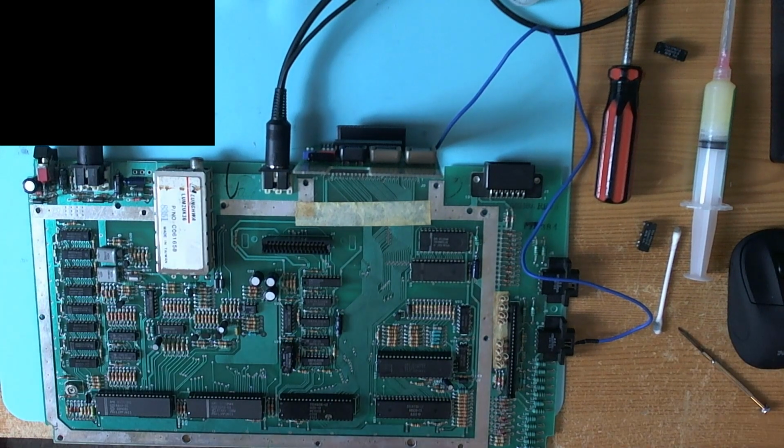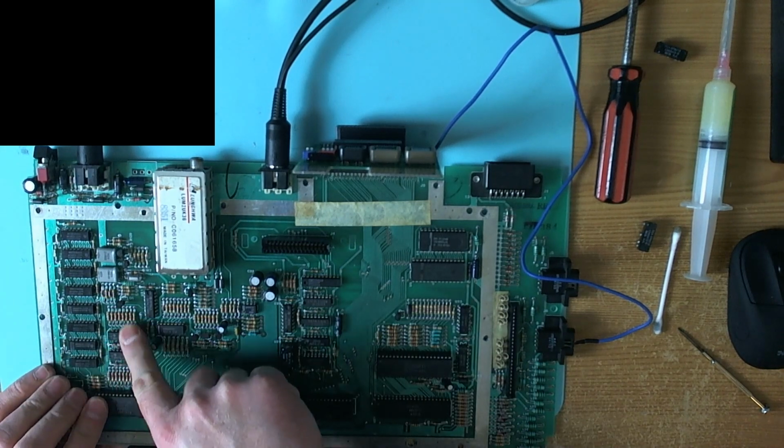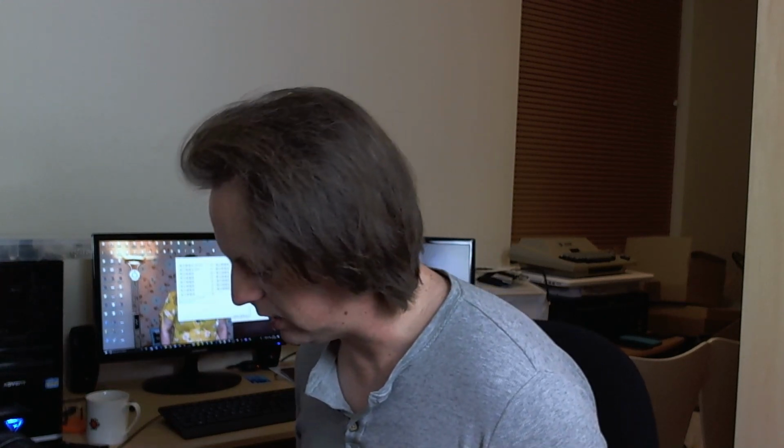Okay, so I'm pretty much at the point where we're going to start replacing this stuff now. So with this machine so far we have looked at the delay line. Fancied that it would be nice if I had the same problem on two machines in a row. That's proved not to be the problem. We've checked the relevant chips that are already in sockets. So the next thing I'll probably try is the 74LS158s. I will socket those, try and replace them, and then if all else fails we'll put sockets under all the RAM, and then if that doesn't fix it then things get really interesting.